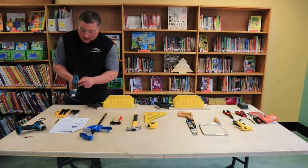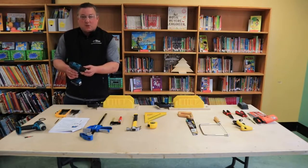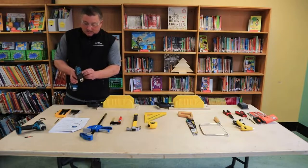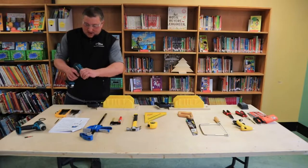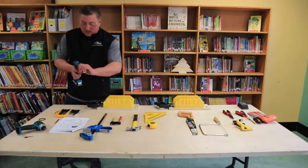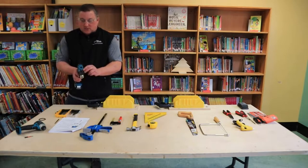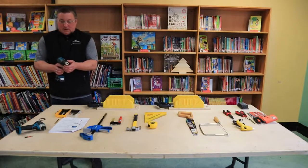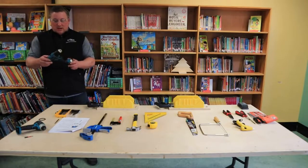There's also a little setting on the drill. Most of the time with this drill we'll actually be drilling holes with a drill bit. There's a little setting that has a drill icon on it, and then different settings depending on the depth or the bit you're using to fasten a screw in. All we're going to be using is just the drill bit setting so it always has full power. It won't stop — it's like a clutch on a car that removes power from the drill.